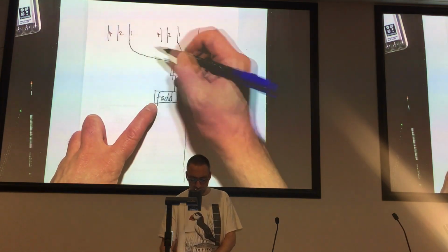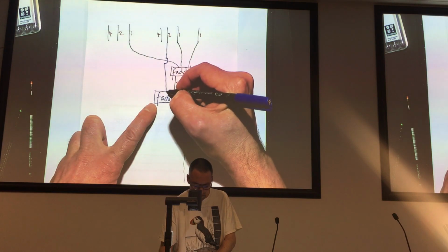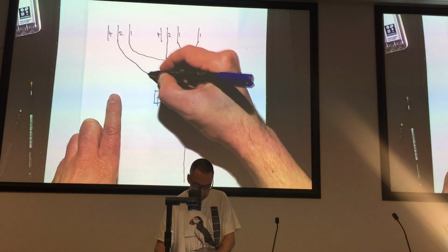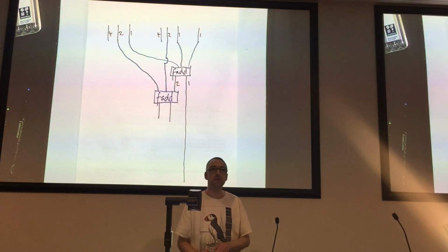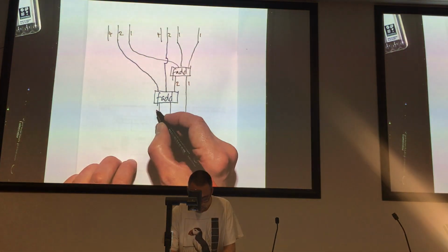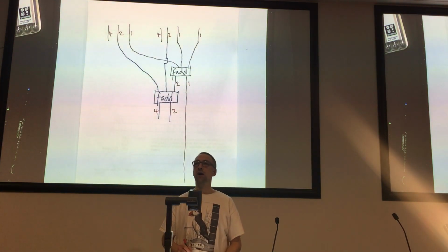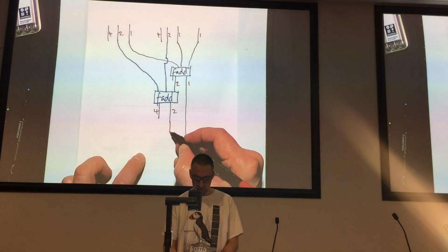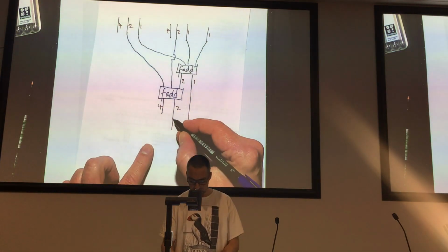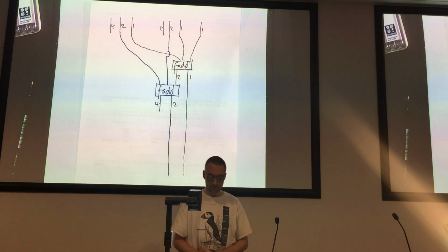So we're going to add up the 3 signals at place value 2 with another full adder. What are the place values that are going to come out? 4 here, 2 here. And now, we've only got 1 signal left of place value 2. So that means I should keep my blue pen for that. We figured out the 2s of the answer.